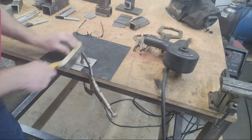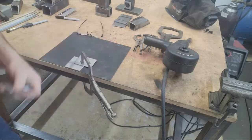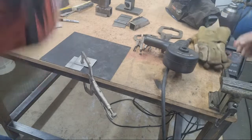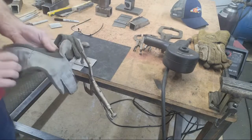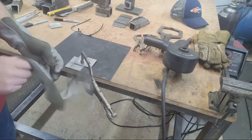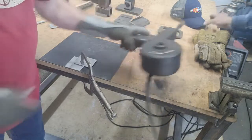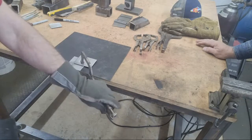There's a scale on aluminum that when you weld, if you don't break that loose, the weld will be ugly. My gloves are a little different than Scott's because most everything I work on in here is super small and thin. He's got some pretty awesome machinery and when he does some heavy welding it's a lot different than what I do. I hope I've got this spool gun set up — I haven't used it in quite some time, I made some practice passes the other day just to set it up.